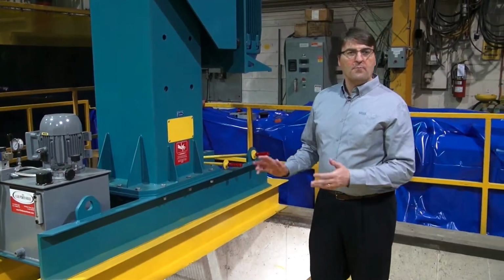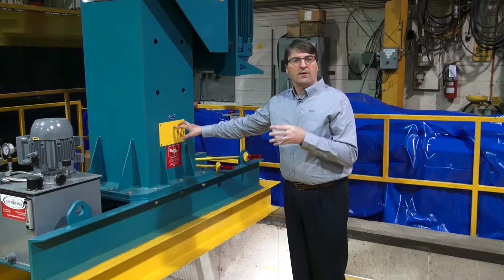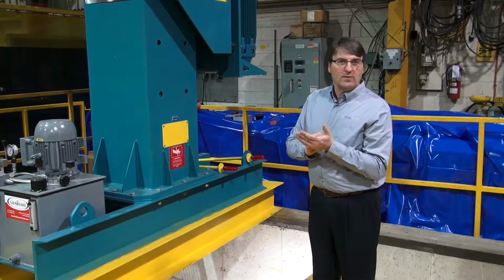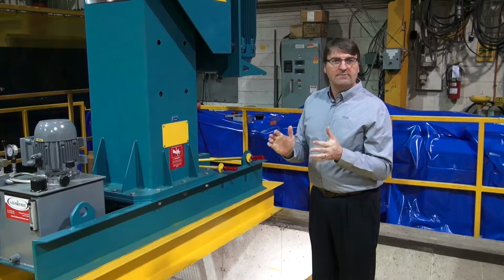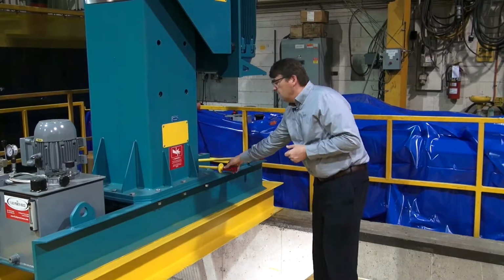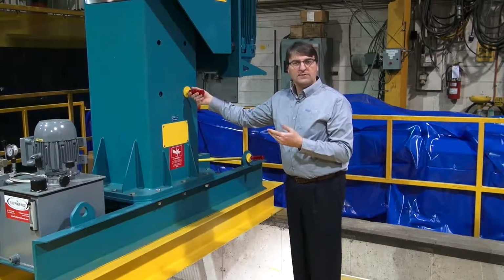Now that we've run through the operation of the unit, I'd like to spend a moment talking about maintenance as well as safety. We've designed maintenance windows that allow the maintenance staff to access the lower bearing and seal assembly of the unit. Of course, to do this maintenance, we want to make sure we follow safety lockout procedures as well as use specifically designed safety devices that we've incorporated. So by bringing the lift up to the midpoint of its travel, we can then install safety locking bars that will prevent any pinch points or hazards during the maintenance operations.